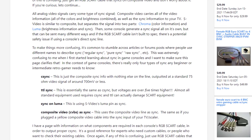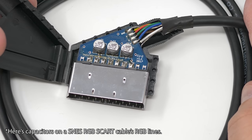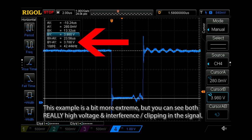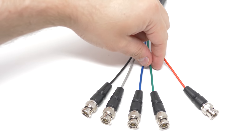So what's the problem with just using C-Sync? Once again, it's badly made cables with improper components and some confusing terms. In the context of retro gaming, the sync information is called composite sync, or C-Sync for short — that's just the sync information. Most manufacturers didn't include the necessary resistors and capacitors required to shape the signal properly on the motherboard itself. If you pull this sync from a console without the correct components in the cable, you'll usually end up with a much higher voltage signal that could potentially kill SCART equipment. This higher voltage sync is often referred to as TTL sync, and in the context of gaming you'll see it used with VGA signals.